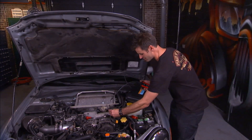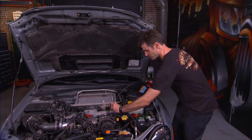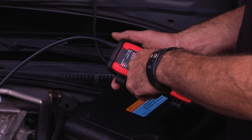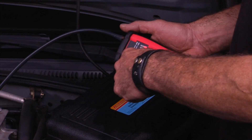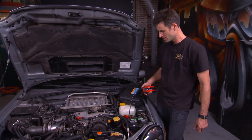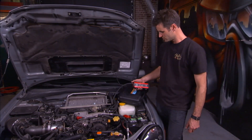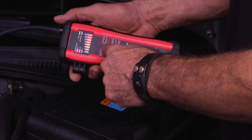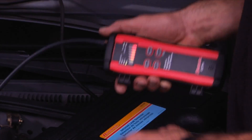Let me show you how it works. I'm going to hit the valve and let a little bit out — you see that? It just went crazy. There are three settings: high, medium, and low. What you want to do is set it on high to pinpoint your leak, and then as you start narrowing it down, move it to low to precisely locate it.